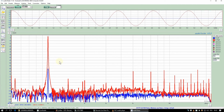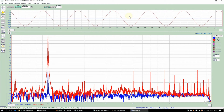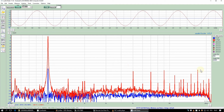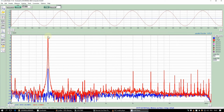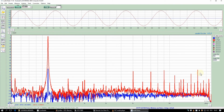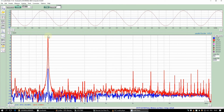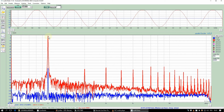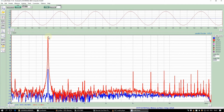And so let's see. We know we have a 1 kilohertz output. Here you can see the waveform. I use the standard line input of the PC, and here we see the FFT. We see the relatively sharp 1 kilohertz main frequency, and then here we see the higher order FFT lines, and well, that looks quite good. We have the main line nearly at the 0 dB level. If I could twiddle around a bit to get it at exactly, yeah, this should be it. Now I don't get it any nearer to 0 dB.